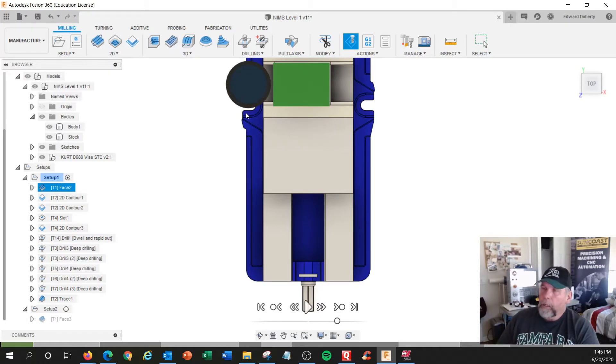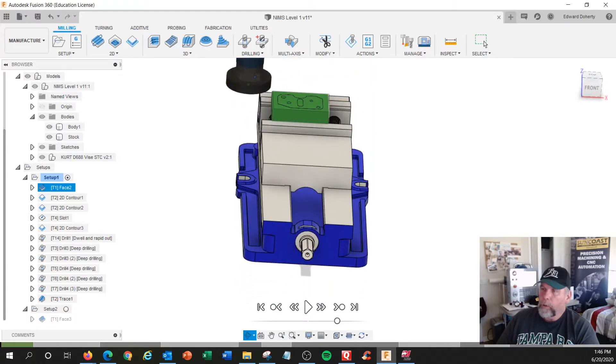You need to be clear. When you go to do your position move, just figure out the radius of the tool, add a little extra, and bring it down. We're going to cut Z zero, so you've got to create Z zero. We're going to make this so we don't have to do any additional math to make the part come out per print.